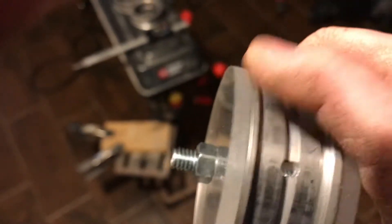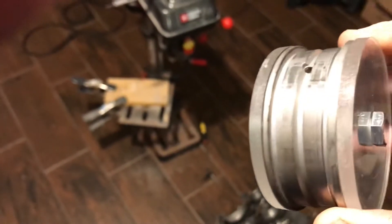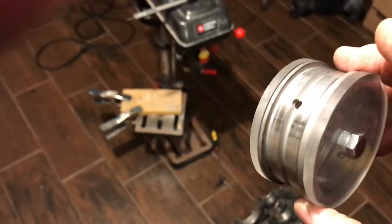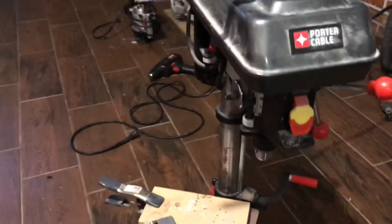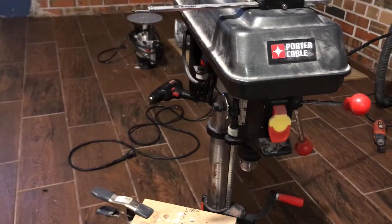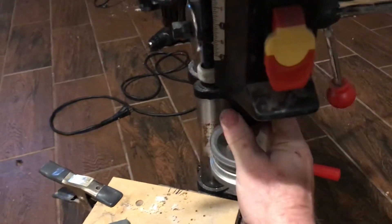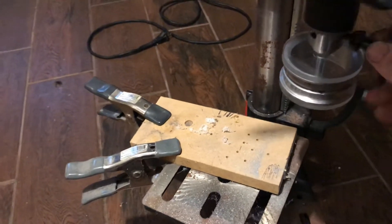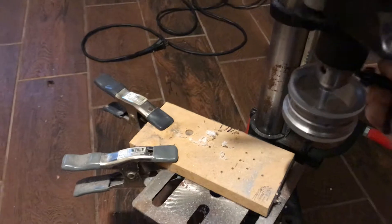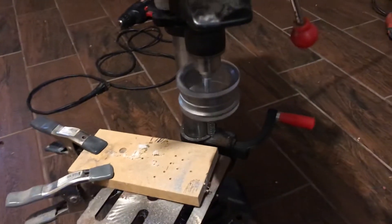This is acrylic — it's what I had laying around. You could probably use anything; this is a good stiff hard plastic, which is what I use. You might be able to do this with a hand drill and two people, but I would use a drill press if you have access to one. Basically, you're going to stick it in there, lock it down, and snug it up — don't go so tight that you mess the threads up because you've got to get it back off.